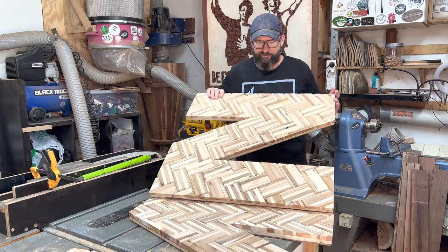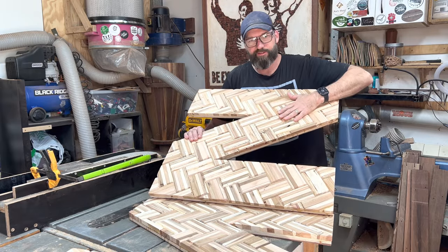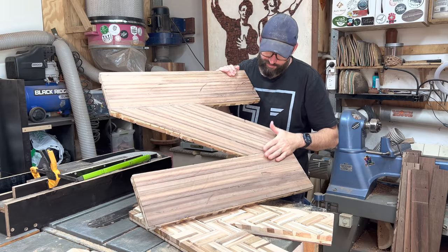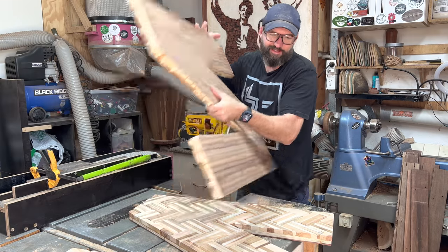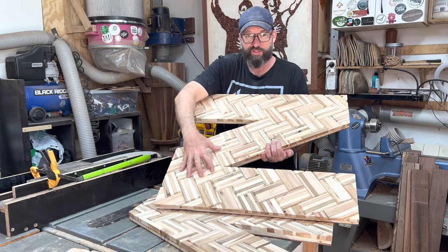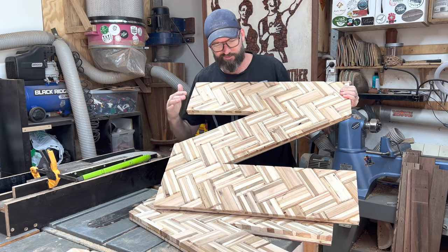Alrighty, I have myself two Z legs. I've maximized the pallets that I had. I've got my decorative pallet tiles on this side, and on the inside, I've veneered all that decking I've got. So the three different layers, individually they wouldn't be very strong at all, but laminated together, and going over where the joints are, has reinforced this to make myself a nice chunky piece of timber.